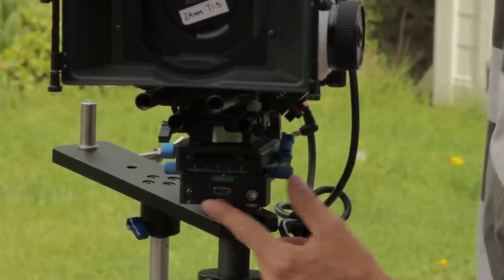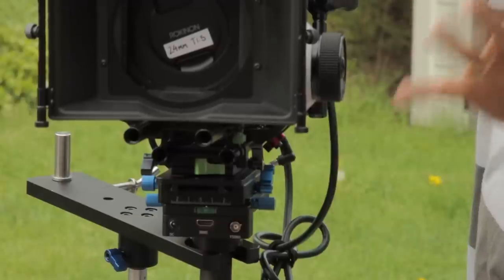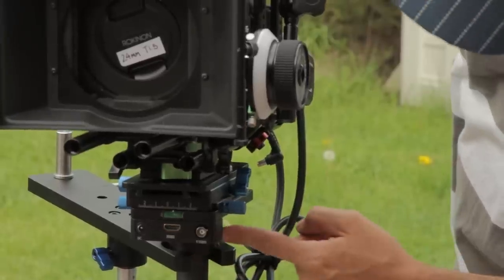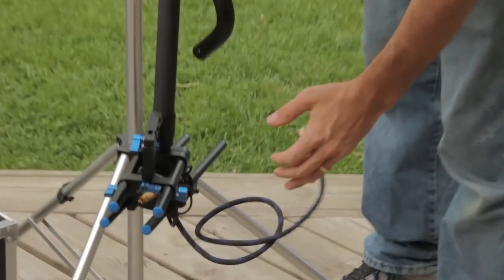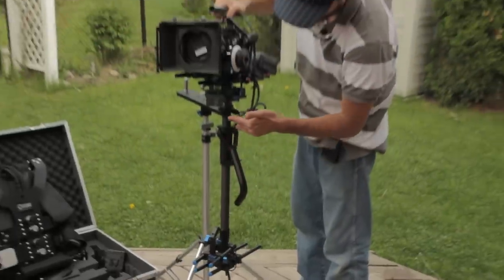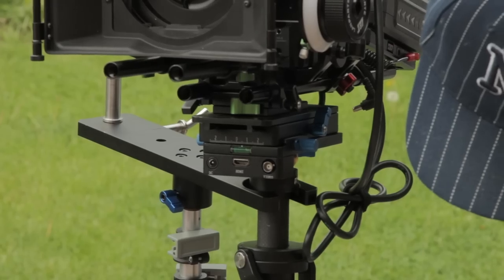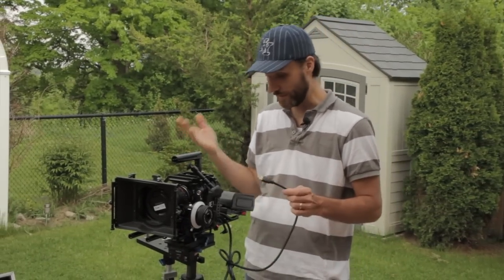This distribution box up here has a DC out, so you can use the included splitters to power your camera and other things like a follow focus. It also has an HDMI in — you can run the HDMI signal from your camera to here, all the wires feed through the inside of the Steadicam and come out at the bottom, so you have an HDMI cable you can plug into your monitor. Same thing for the battery: if you put a V-mount battery on the bottom as a counterweight, the power gets taken up here and you can split it off to run to your camera. It also has an SDI video connection, so it's pretty good in the sense that you can use it with all these industry standard big cameras.